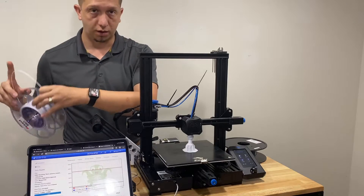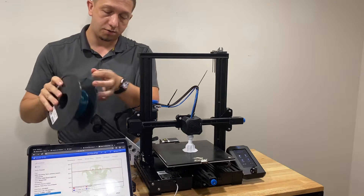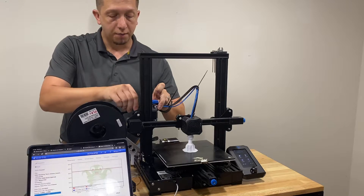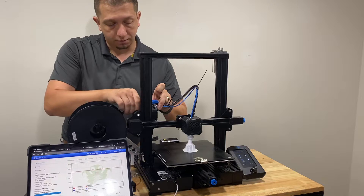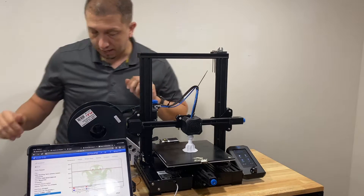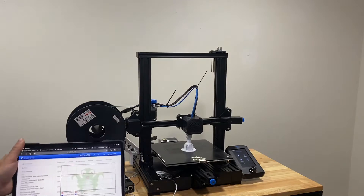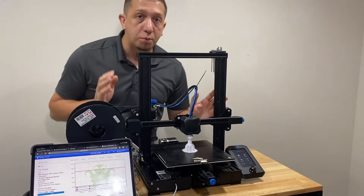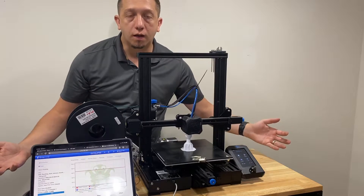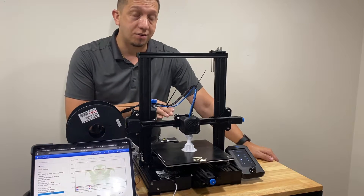I've got the old filament off. I'm putting on some green PLA — just a roll I had and want to use. I'm going to thread it back through the extruder, being very gentle, making sure not to move my X axis in any way, and push it through until I can't push anymore. You might get a little blob on your print from pushing the filament through to the end — that's okay. We've got it loaded, so now we come back to OctoPrint and hit Resume, and the print should kick right back off. This is a cool method to save your print, especially on a very large print on a CR-10. You can use more than one roll of PLA, which is actually pretty awesome. We'll follow up when it's done to see if it's a success or failure.